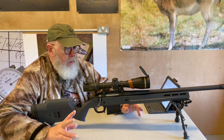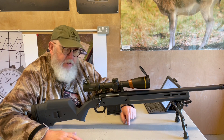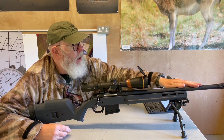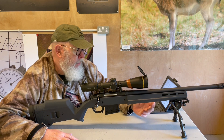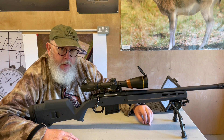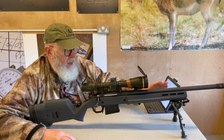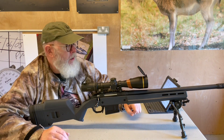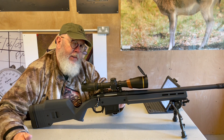Performance-wise they shoot very well, and I think what Ruger wants to do — cash in on the tactical/practical precision market — is produce something with a bit more flair to it. You have a 0.87-inch diameter heavy barrel, and this gun is in 6.5 Creedmoor with a 1-in-8 twist. If you get the .308 version — the only other option — it's a 1-in-10 twist. The muzzle is threaded 5/8 by 24 UNEF (Unified National Extra Fine), so suppressors aren't a problem, as a lot of these tactical/precision guns have that thread. They also supply a rather fanciful muzzle brake with it.